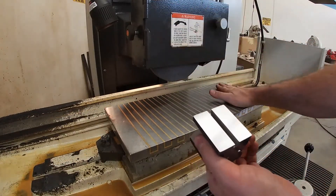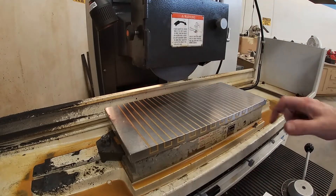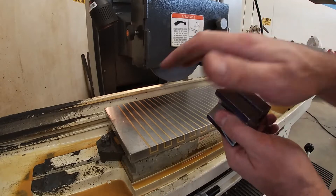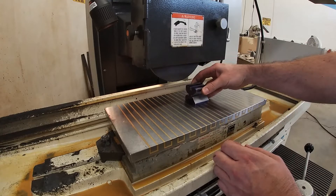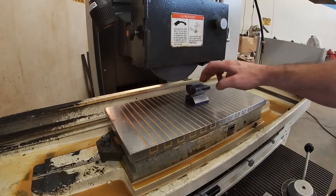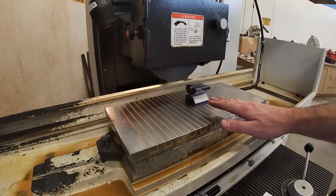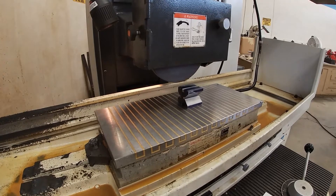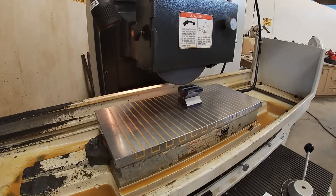Everything is as clean as I can get it. Use the palm of your clean hand and run it across the chuck — you'll feel the little granules that a paper towel leaves behind. Make sure your part is nice and clean. Even though I already just ground this, I'm still going to give it the tap and rock test to make sure it is as clean and flat as I think it is. I'll go ahead and turn on my magnet and set my zero stop for the amount of material I calculated I need to remove.